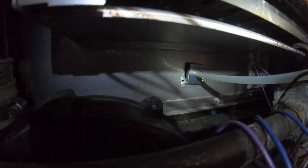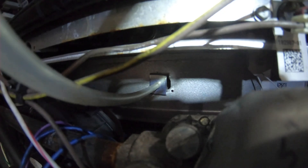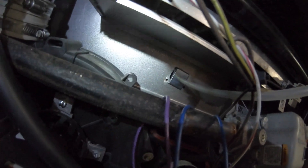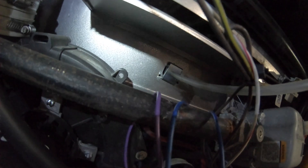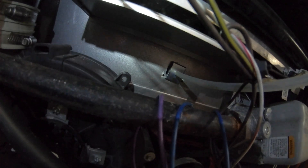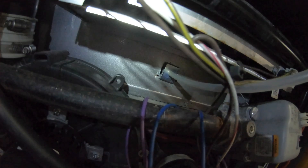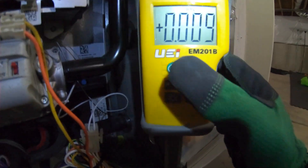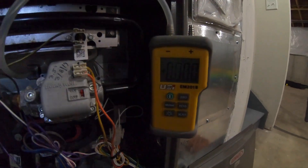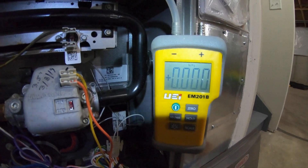As you can see, the actual probe isn't covering the hole completely — there's probably a quarter inch gap on each side. I don't do anything about it; I still think it gives a pretty accurate reading. Let me know guys if you cover it with tape or if it has an effect on the reading. Since the probe is in and the meter is showing something, we'll press zero to zero it out, and then turn the power on — the blower is supposed to start.